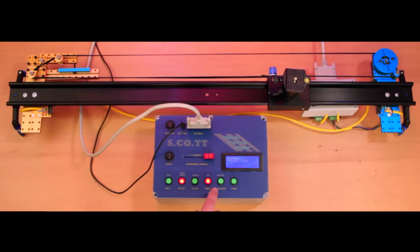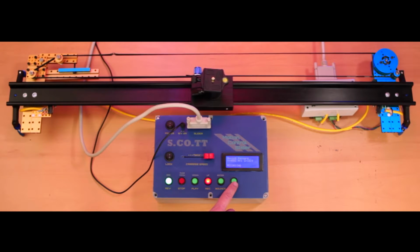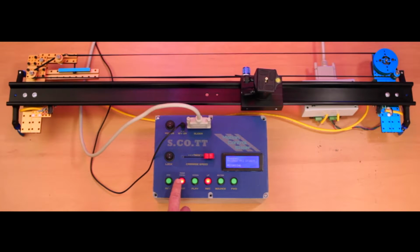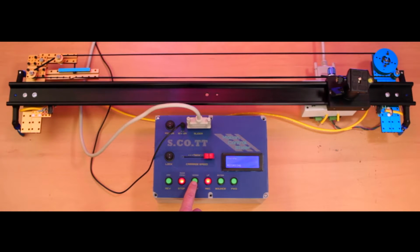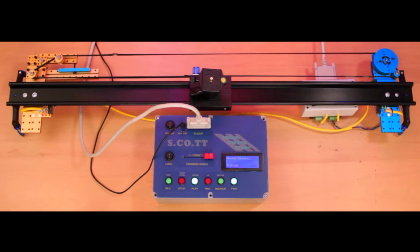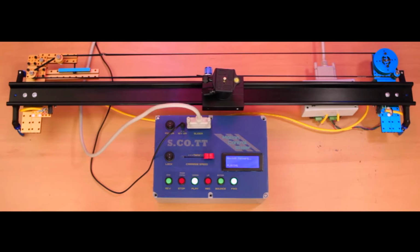I guess the coolest part of the project are the record and play buttons. When record is pressed and lit up, any change to the camera's movement is saved in memory, along with a timestamp. Basically, it records when forward, stop, or reverse are pressed, and records any changes in the value coming from the speed potentiometer. Since it's based on time to millisecond precision, you can have camera moves match tightly to a planned sequence. The record button toggles recording on and off, but hitting play will stop recording and go directly to playback mode.